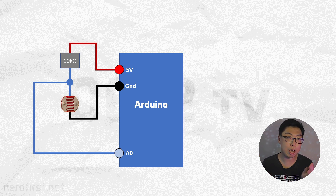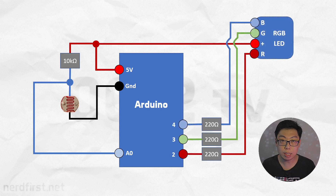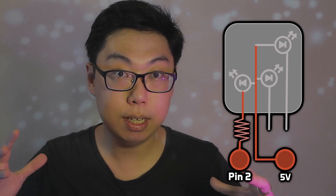We take a reading from the potential divider on one of the Arduino's analog pins. At the same time, we also have the RGB LED hooked up. This is a 4-pin component — basically 3 LEDs of each color sharing the same voltage source — going through resistors and sinking through the GPIO pins on the Arduino. This means that in order to switch on one of the colors, you'll need to somewhat unintuitively set its pin low, since that makes the pin go to ground, completing the circuit. Setting the pin high means both ends of the circuit are at 5 volts — since there's no potential difference, there's no current flow. The circuit is as simple as that.